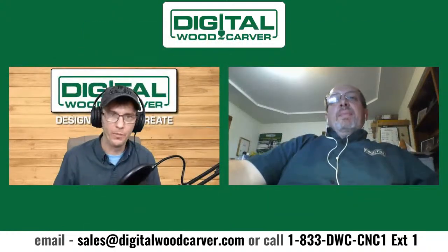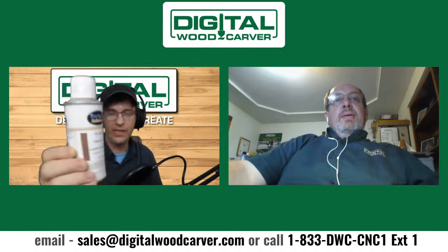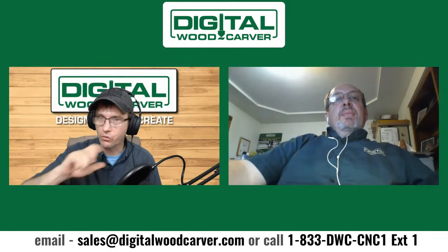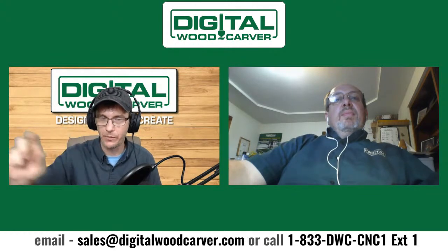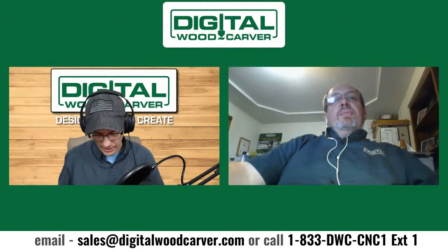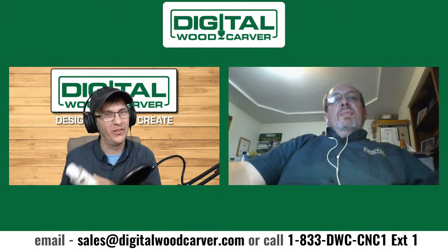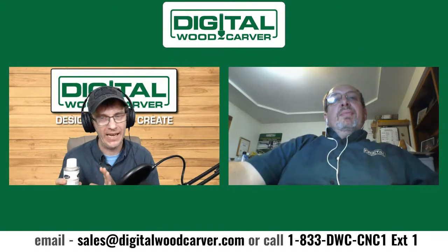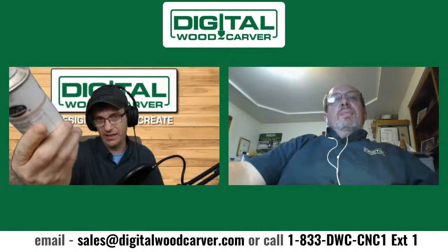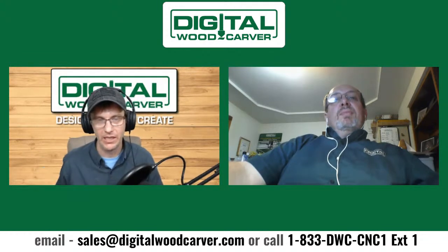And we'll pop back into the big screen. It's made by Touch-Up Solutions and it's a toner dye. Now it comes in a spray format, so you can really pinpoint where you want it to go. And then it wipes really nicely. When I use this, I tend to go with their clear coat so the two match. This is their pre-cat, a pre-catalyzed lacquer, their top coat over the dyes.